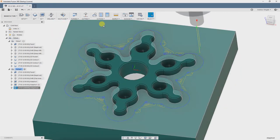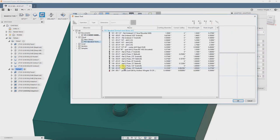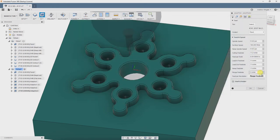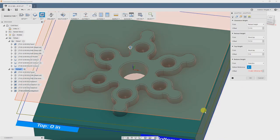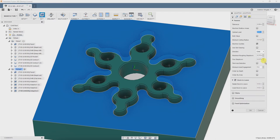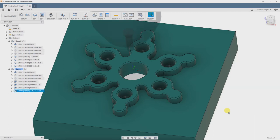Let's move on to our next tool. We're going to use 3D Adaptive again, and this time we're going to choose the 1/8 inch end mill. Speeds and feeds are good. Moving to Geometry — in REST Machining, we are going to change the source to Previous Operations again. In Heights, we are going to need to change the bottom height to the bottom face. Passes tab — we fill in 15 thou for our stepover as our chart says, stepdowns will remain at 3/8 of an inch, and we're going to leave 7 thou stock here. I'm leaving 7 thou because Fusion does some unexpected things sometimes when it comes to REST Machining and leaving the exact same amount of stock as we did in previous operations, so I usually like to leave just a little bit more.